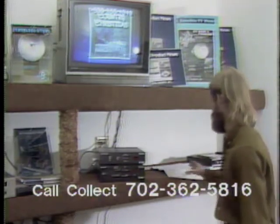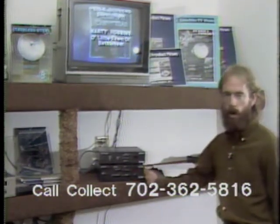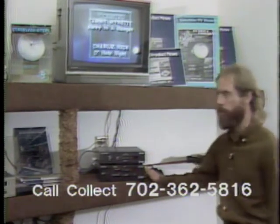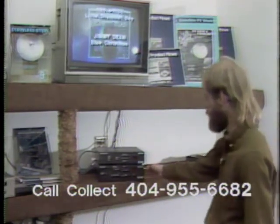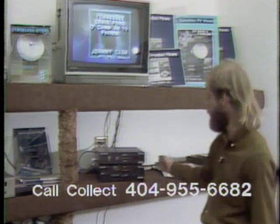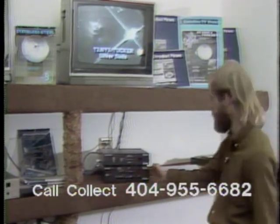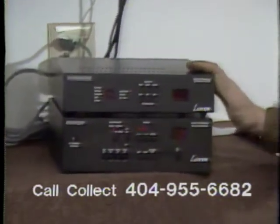Now the reason I chose SATCOM 3 is because it's the one most watched, most people are the most familiar with this, and it is very full of transponders. Okay, now once I have stored all of my transponder positions, I can turn my AFC on, and the Luxor receiver is programmed at this time. Okay, now I am ready to program the Luxor actuator.